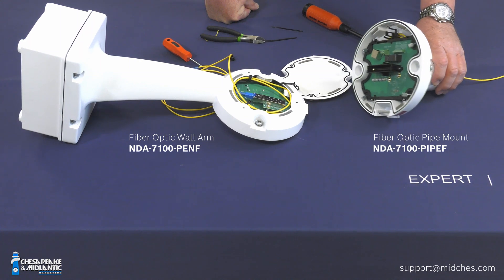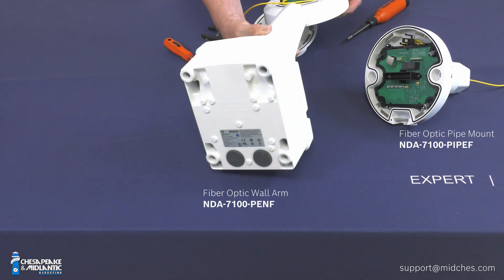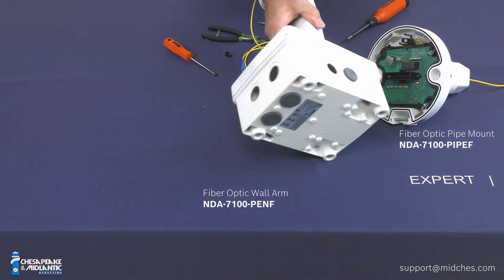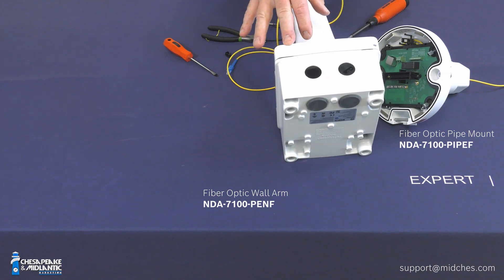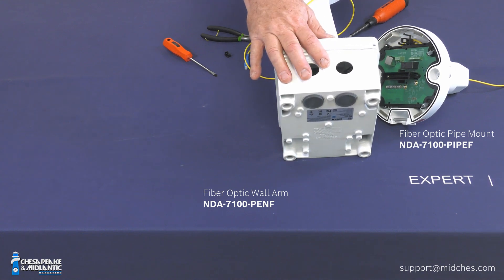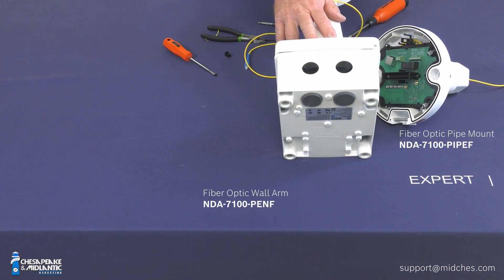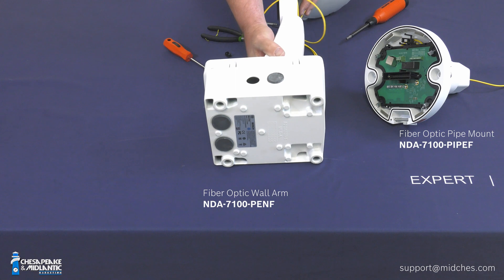The surveillance cabinet — the back box — is worth highlighting. It's very flexible: you can bring in cabling or conduit from the back, the side, or the bottom. The surveillance cabinet comes with two side entries and two bottom entries. The box is also provided with grommets to keep those entry points watertight if not in use. They're a typical conduit size, so you can bring conduit right in. You can separate your power from your fiber or your power from your Cat6 if needed, and there's plenty of space inside the security cabinet.